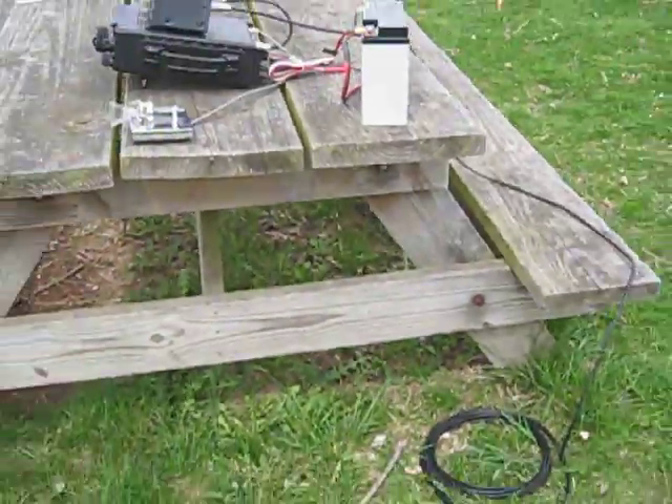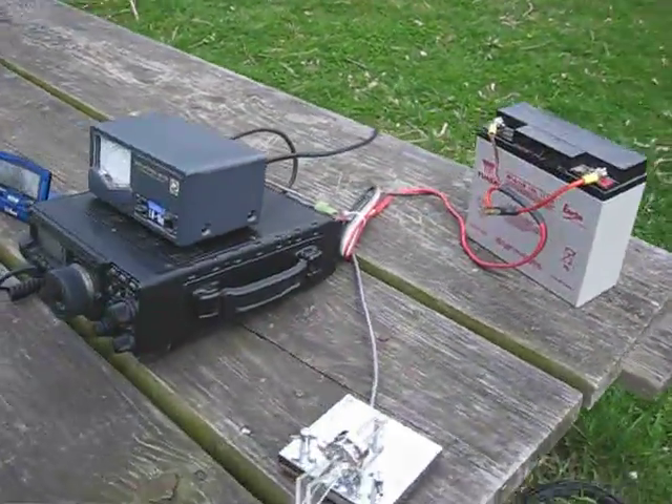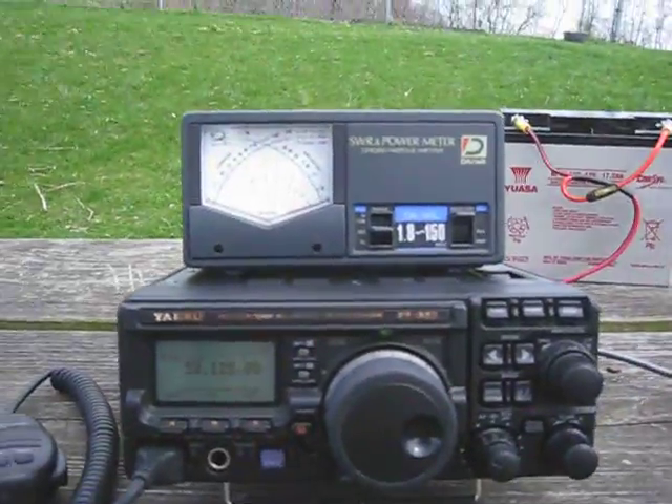It's super simple. You can make it as a sloping antenna. You don't have to have it that high in the air. It's about 30 feet in the air right now. If you can get it that high, that's just great. But if not, I've seen them work as low as five feet above the ground.